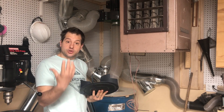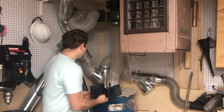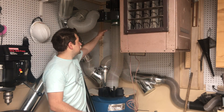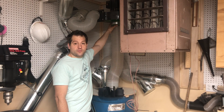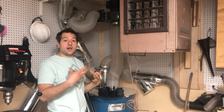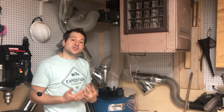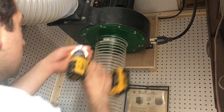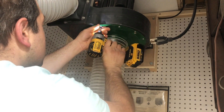I'm recording this video because I want to show you guys how I did it so you can do the same thing in your own shop. One notable modification I already made is upgrading the existing 5 inch opening on the Harbor Freight dust collector to a 6 inch adapter to make it a lot larger so I don't lose as much CFM. Either way, let's get started — we're going to start by removing the existing cover, held in place with several number two Phillips head screws.